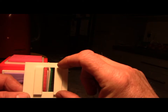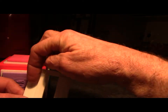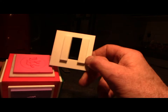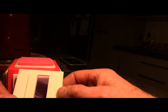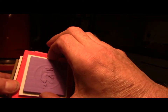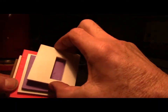I had a few stuff ups, I got these mixed up, and they have different sizing here. This is a longer one, some are smaller. You've got the short gap, and you've got the long gap. So it's really, really important to label the top inner, top outer one, and top outer two, and left inner, left outer one, left outer two, and keep them labeled and keep them together. I assembled it up and I had it glued up, and see how the white, there's hardly any movement really in the square. Well, if you have the wrong one in the wrong hole, it can flop around.